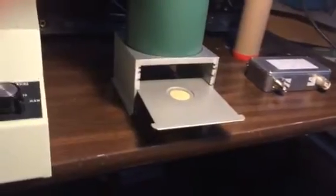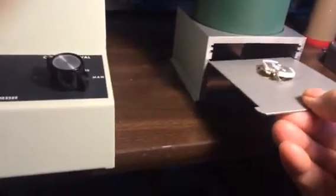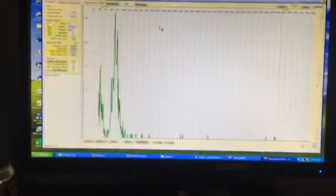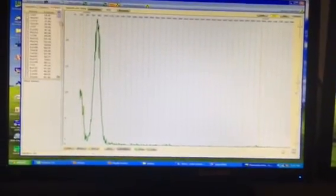This isn't a standard, but this is a good test — I'll put in a source out of a smoke detector and dump that in here. This should give me possibly two peaks in gamma, although its primary output of course is alpha particles. There are two gamma peaks: one strong one and one weak one that will show up.